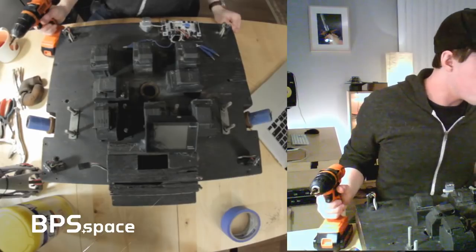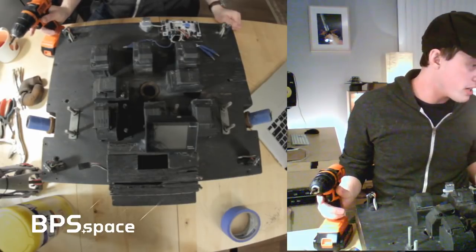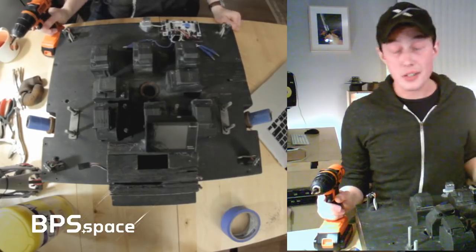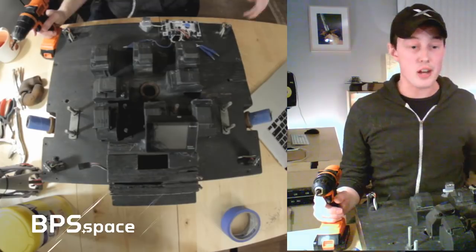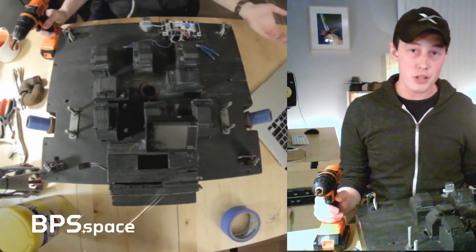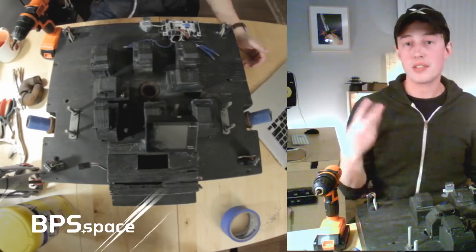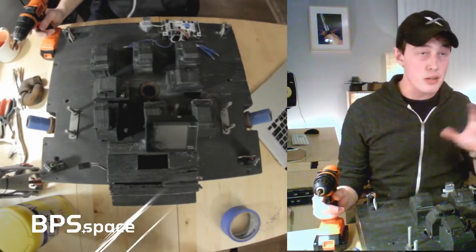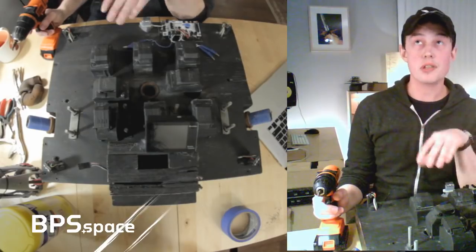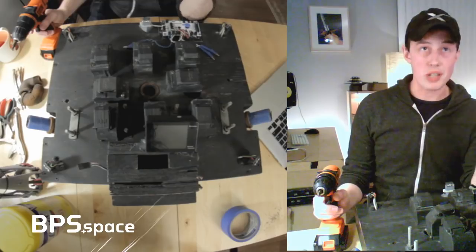What kind of controller is he using? Standard PID or gain scheduling or some type of online adaptive PID? Hey, Adrian, that's a good question. Right now, it is a standard PID with non-adaptive gains. That is obviously non-ideal for really long burn times or huge changing center of pressure, center of mass, airspeed, all of this stuff. But for the model scale, a non-adaptive set of gains is actually pretty sufficient, even with a decent thrust spike at the beginning of the curve.